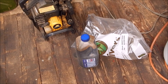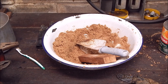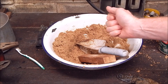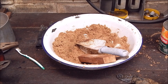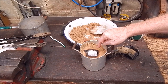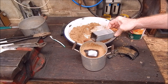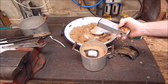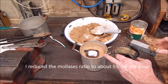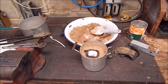So now it's a matter of going back to the sand. Looking at the mix in the video, I'd say his proportion looked to be about 10% — that's just a rough guess, no more than 10%. And when you clump it, it should clump and not stick to your hands a lot. Now I want some square-section aluminium for another model engine I'm going to make. So to do this, I just use this as the former — just a bit of tubing — put it in. It's a fair depth. Packed it down and just pulled it out.